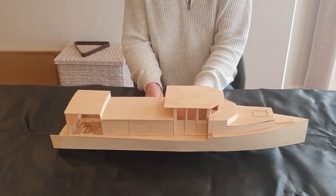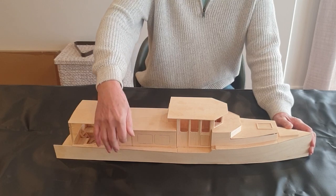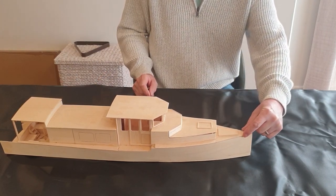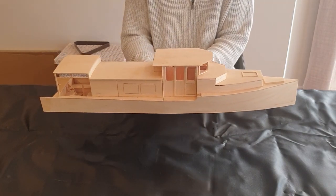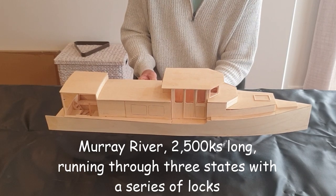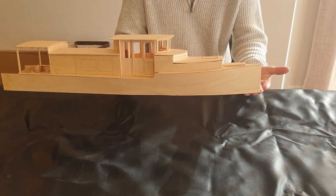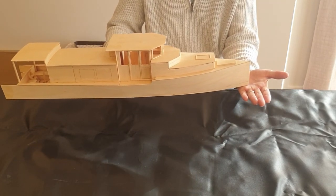There's a good wide walk-around — almost 18 inches or 450mm around the sides — with safety railing of course. At the front I've designed a system for a gangplank that attaches at the front and runs down to the shore when pulling into shallow banks. The main area this boat is designed for is the Murray River and lower lakes, inland and sheltered waters of South Australia, Victoria and New South Wales. That river runs through three states so we've got about two and a half thousand kilometers of water to play with. I've factored in a lot of very shallow water — the bottom of the boat tapers up about 150mm or six inches toward the front, allowing us to get right in close to shallow banks and nose the front of the boat right up to the water's edge.